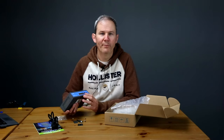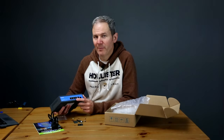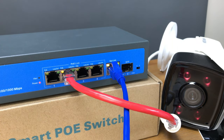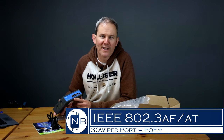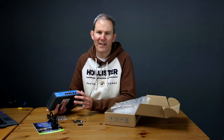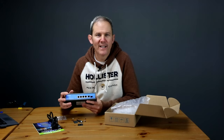Use the external earth screw for grounding the device if it isn't connected to a grounded power outlet and there are devices connected to the front ports. On the front, we have four gigabit ports. If you need more, Yanli sells PoE switches in various configurations up to 16 ports. Gigabit ports are more than enough bandwidth to support 4K cameras or higher. Simply plug in your non-PoE or PoE active devices and the switch will automatically identify if they accept Power over Ethernet. The ports comply with IEEE 802.3 AF/AT PoE standards and support up to 30 watts per port, which means it's PoE+. Make sure not to plug any PoE passive devices into the switch because they could damage the device. The total usable PoE power budget across all four ports is 78 watts, and the average dome or bullet camera uses about 7 watts.